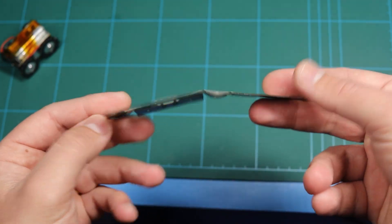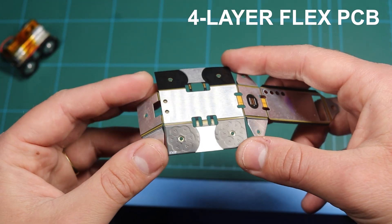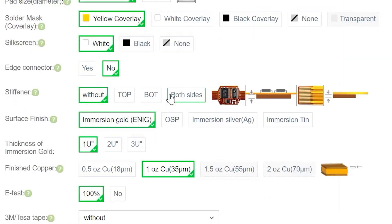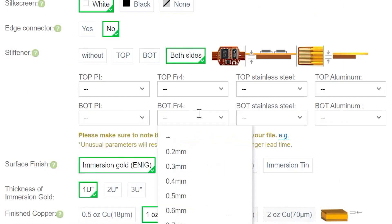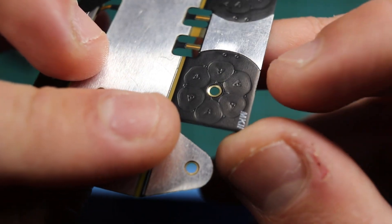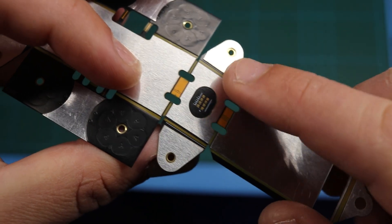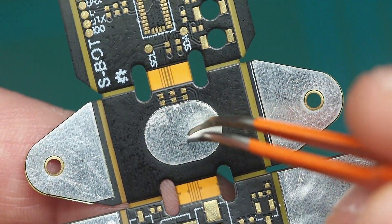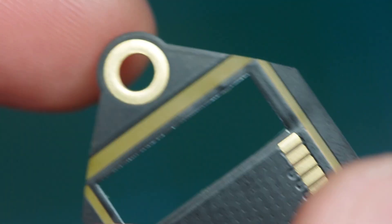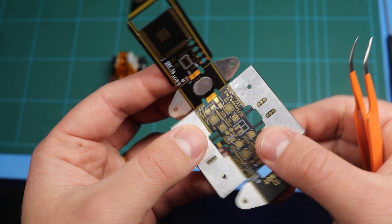This circuit is made from a flexible PCB but most of the areas are covered with thin aluminum stiffeners. On PCBWay's website there's a variety of stiffeners to choose from with different thicknesses. The stator area does not contain a stiffener so that it would be as close as possible to the rotor. The proximity sensor at the front has a cutout, but at the back it also has another piece of aluminum stiffener so that the pads underneath don't bend easily. All these yellow regions do not contain a solder mask, which makes them easier to bend.